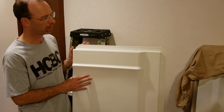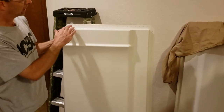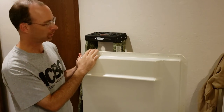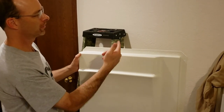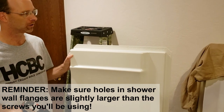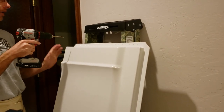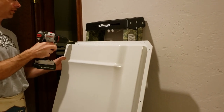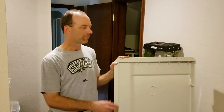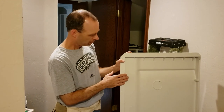This is the right-hand side panel, so I'm going to prepare it for installation. It has holes marked where screws attach to the wall and where they go into studs. Since I've got plywood on the wall, I'm going to pick about every fourth or fifth fastener hole and pre-drill those. I'm using a high-speed setting with very light pressure on an eleven sixty-fourth inch bit — that'll keep the plastic from cracking.